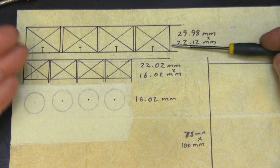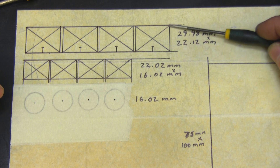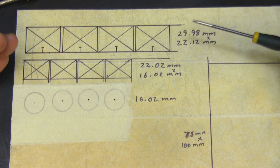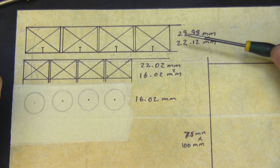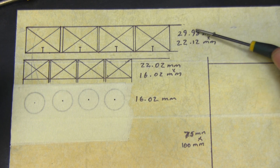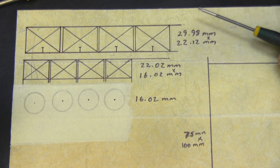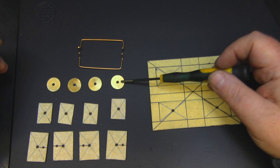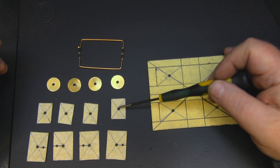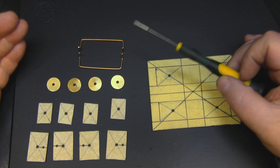I like to use a sharpie — the thickness gives me about 0.5mm of play so I cut to the outside line of the sharpie and then take it down to the actual measurements using a sanding board. This brass is quite soft — not as soft as copper — and doesn't take that long to sand down. Five gigahertz is a higher frequency and not as forgiving if you're out with your measurements, but you don't have to be too precise — rounding these numbers up or down, you're perfectly fine.